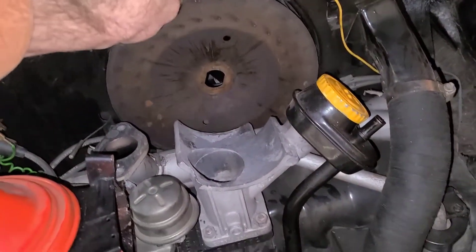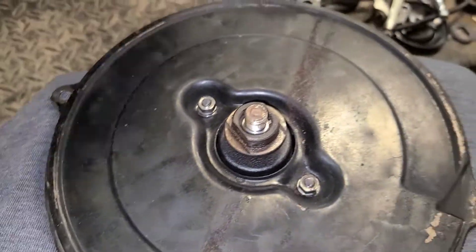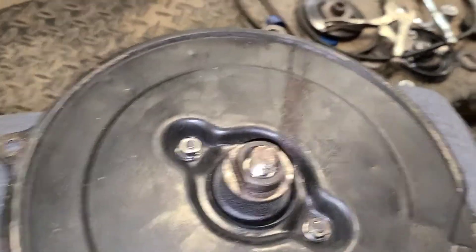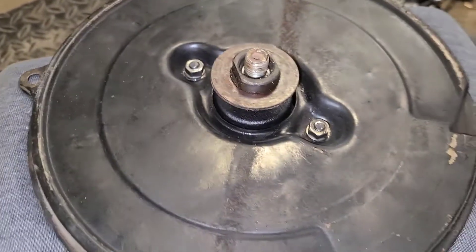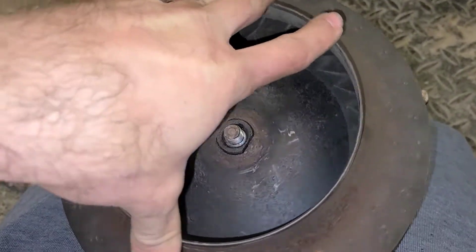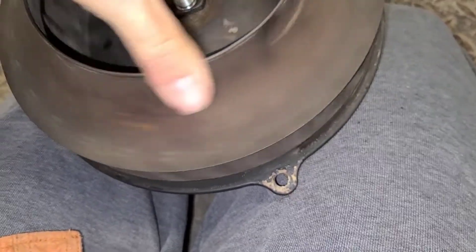With the generator out you can simply pull your fan out of the car. For example, with no shims in place if I put the fan on you can hear that we're rubbing. I had two originally so I know two is about right. I'm going to take two shims — you could take one if you wanted to try first. I ended up going with four shims and might even add a fifth, but it seems to be pretty much okay.